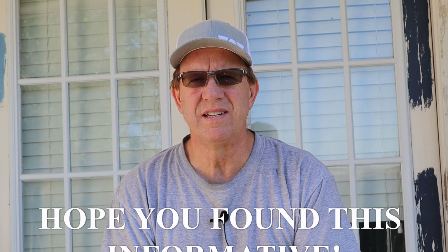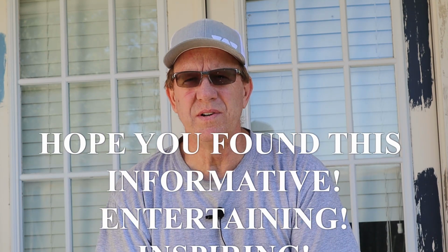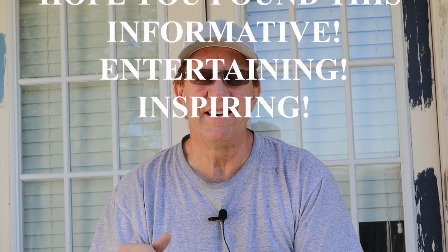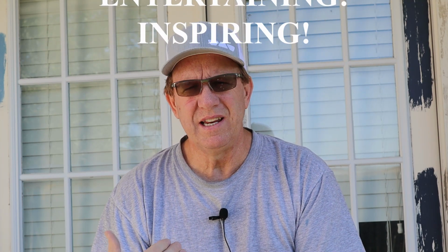All right, so after many days and quite a few hours, the house is finally sanded. Yeah, it was a lot of extra work, probably not needed, but I learned quite a few things by doing so, and that is I found problem areas that need to be addressed. I got a lot of nails that are backed out that need to be set. I got areas that need attention as far as caulking. I got some cracks. I got some rot to replace. So while it was a lot of work, it was worth it.